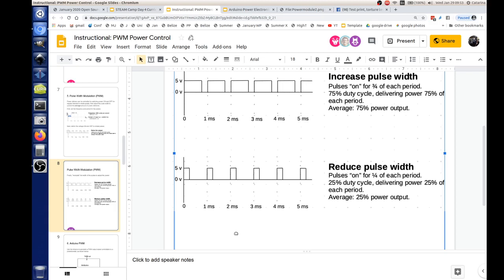What we're actually talking about, this curve that we're looking at, you see it says on the side, we're going from 0 volts up to 5 volts. Let's say the leading edge of the pulse is rising and it's at the 2.5 volt level, it hasn't quite reached the top. Then 2.5 volts is being dissipated here, but 2.5 volts is being dissipated somewhere else in the load. That extra 2.5 volts can result in a lot of power that has to be dissipated at that time. So we have to keep these in mind, because we have to size heat sinks for that and figure out how much power we're going to dissipate in the different components.